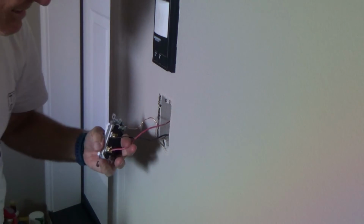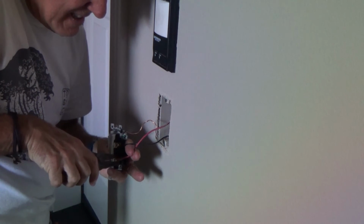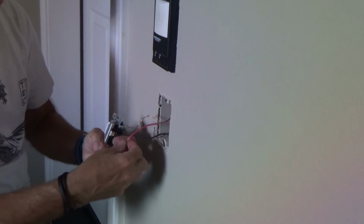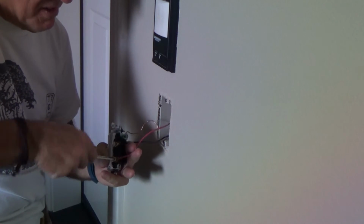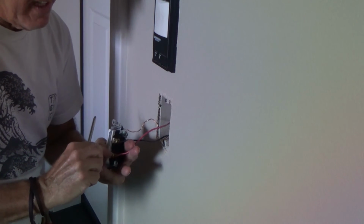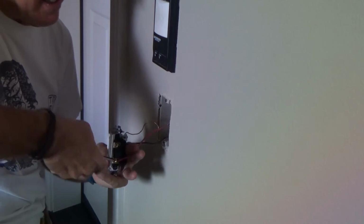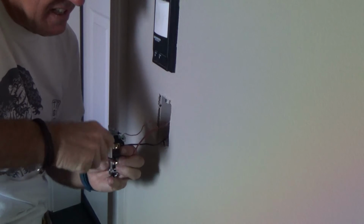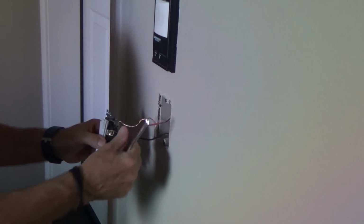I could screw it right now, but I can take the tip of it and kind of bend it around more. Sometimes that gives it a better connection. Sometimes if you don't do that, when you start this, the loop is a little bit big, the screw kind of fits on one side, and half the wire is sticking out beyond the screw. And this way it just gives you a nice, good, tight connection. Let's see. Okay, like that.